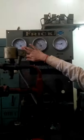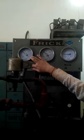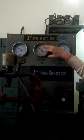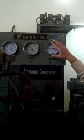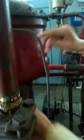For control of this compressor, there are three gauges. The first is an oil pressure gauge for the lubricating oil present in the crankcase. The second is a suction pressure gauge for the ammonia coming from the evaporator. The third is a discharge pressure gauge. The respective lines connect to each of these gauges on this side of the compressor.